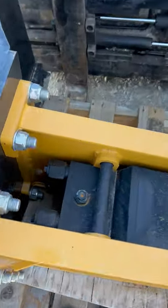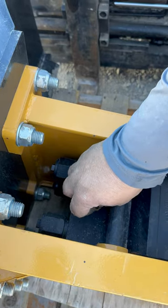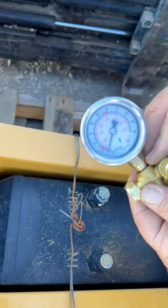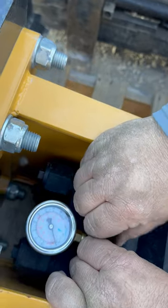So you have your nuts right here, and we're going to remove the top one in order to get to the port to show how much nitrogen charge you have on there. And here is the gauge that comes with it. And you want it to be around 200 to 230 — that's your goal.